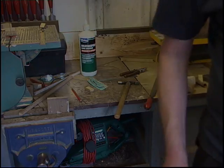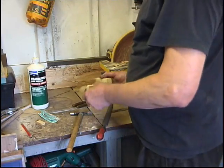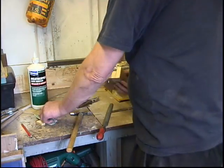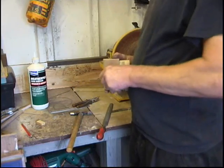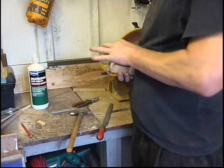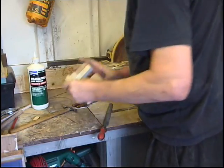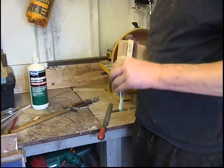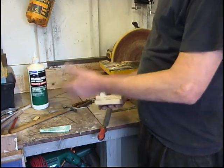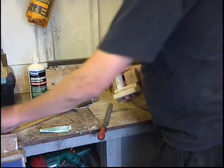See how good the glue is. The car body filler we've put on here has dried up, roughly sanded it. It's just a case of sandpaper — sand it down, all the corners, all these edges are going to be rounded off. You've got to break all the corners otherwise I'll have problems getting the pattern out of the mould. Nothing special about sanding, it just takes time — various grades of sandpaper.